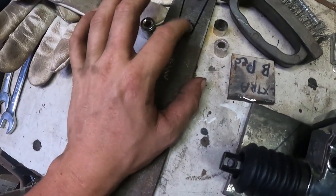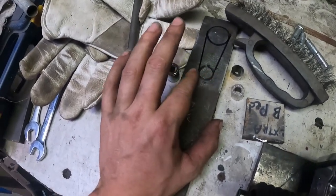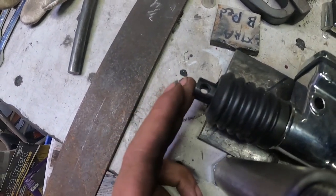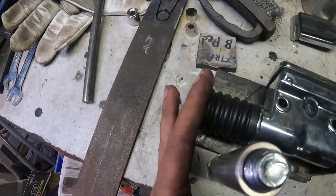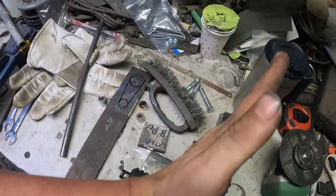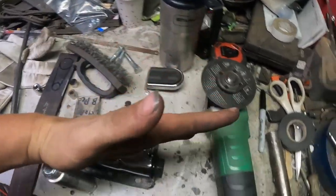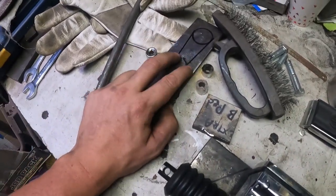One and three-quarters — I made it just a little bit longer so I can hit it with the angle grinder or bench grinder and just whittle it down to the point where it can sit flush. It'll be long enough where I get the maximum amount of leverage, but not so long that I'd need a really funky, weird, angled foot pedal. Because if it's too long, my foot pedal won't go all the way down. If it's too short, it'll go way too far.